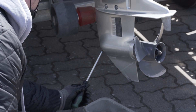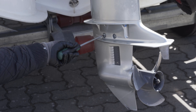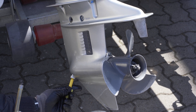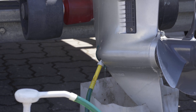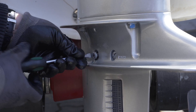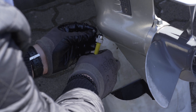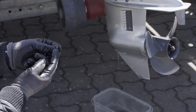To drain the gear oil, the outboard motor must first be in a vertical and upright position. First, the lower drain plug should be loosened. Remove the top drain plug to release the vacuum and allow the oil to drain freely. Use an oil hand pump to refill the oil and keep filling until the lubricant is flowing freely from the top hole and is free from air bubbles. The screws can then be tightened again — make sure you tighten the top screw first and then the lower screw. Be sure to replace any washers before tightening the screws by hand. On some outboards, the lower drain screw is magnetic, which helps to identify any serious wear problems inside the case.